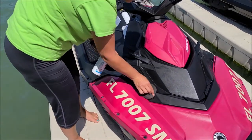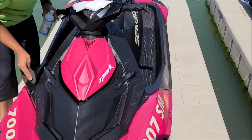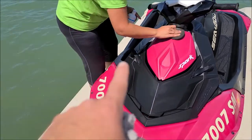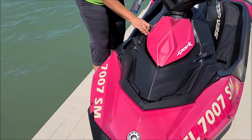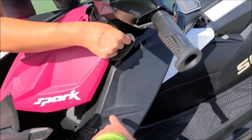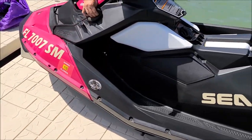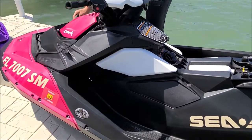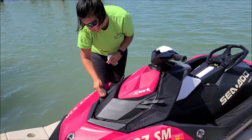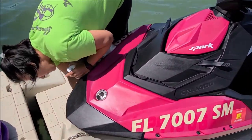We engineered this stuff specifically to work great in the sun, in salt or fresh water, with all the friction caused by water and erosion over time. It's going to stay on there. In fact, when it gets wet after it's done, it'll bead water like you just waxed it, like a car when you first apply a good coat of protection. Make sure you get into all these nooks and crannies. You put a relatively heavy coat on first, let that sit for about 10 minutes after you're done with the whole ski, then you'll go around and put another lighter coat on.